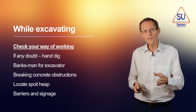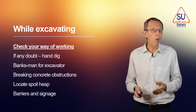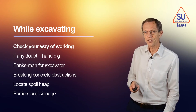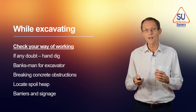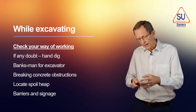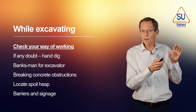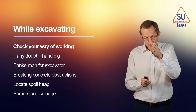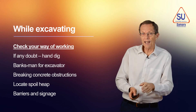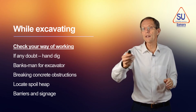When you're digging — particularly in a city — you may come across concrete in the excavation. This should make you think: why is there concrete there? Is it because somebody put something there before and they're protecting a service like a pipe or cable underneath? Check carefully by hand digging. Also think about where you're putting the excavated material — the spoil. You need to put it in a pile, but not too close to the excavation, because it will fall in or cause the sides to collapse and could kill somebody. Put the spoil heap safely, maybe 5–10 metres away.